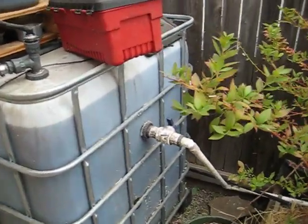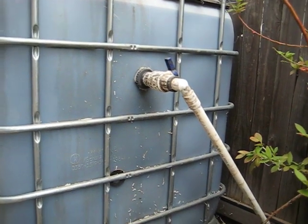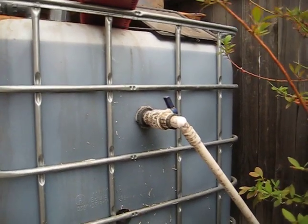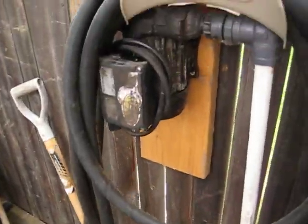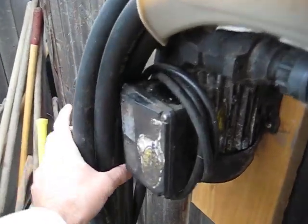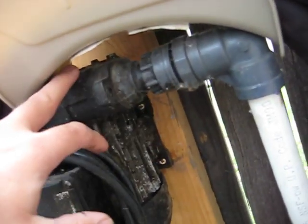From the tank, I put the outlet about two-thirds of the way up, figuring I don't want to accidentally catch anything on the bottom. That gives me about 70 gallons to work with from there to the top. I have a shut-off valve and another tank adapter, and that runs through a 3/4-inch schedule 40 PVC pipe. This is the outlet that goes to my fuel pump, which is close to my driveway — it makes it easy to fill up the car or truck. This is a 120-volt AC pump, so I have to hook up an extension cord. This pump has a filter already inside and the oil comes out clean, so I don't need to filter it further.